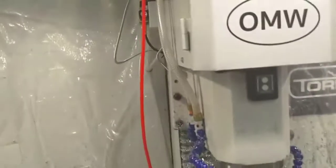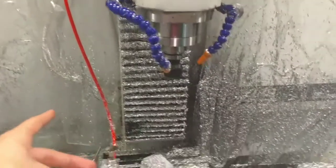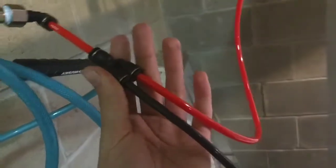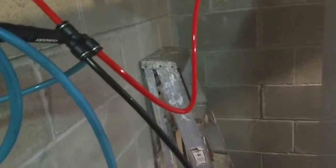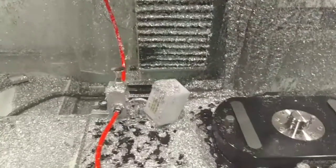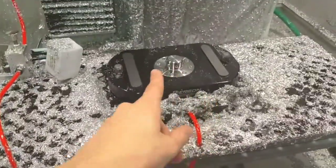You can see how I have it plumbed in here. Jay had to have known that Tormach users were going to be using these, because he provided a T that perfectly fits the power drawbar air line, which just so happens to go to my supply line. That made the install really easy — basically I ran the line up through the top hole of my enclosure, down to the handle, and then fed it down through to stay out of the way and to the pallet.